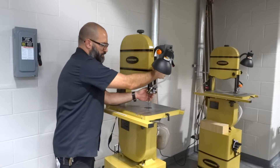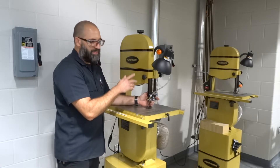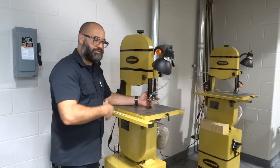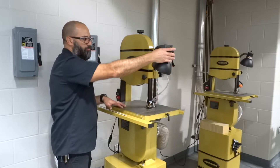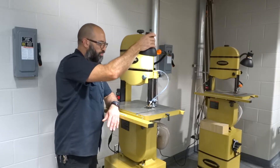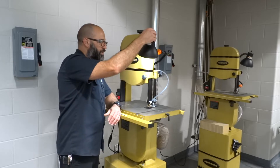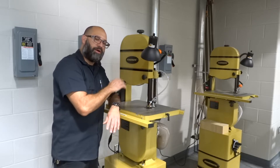If we have a lower guide, that means this whole assembly right here is the upper guide. Both the lower guide and upper guide sometimes get a little bit thrown off when the blade starts to settle in the tire. These are things that students should not be adjusting — if something seems wrong or it's making some noise, just make sure that you let me know. We also have a lamp here, which helps us follow our line so we can see it. When you use a lamp, make sure your line is not sitting in a shadow, as that makes it harder to see exactly what you're trying to cut. On the back side, there are some tension adjustments that students don't need to worry about.